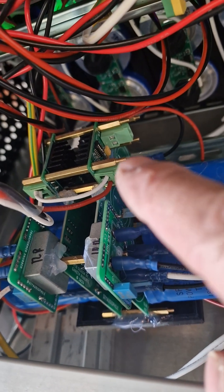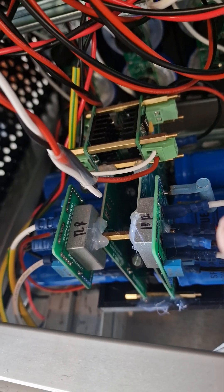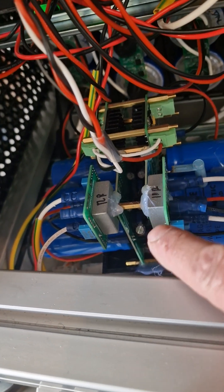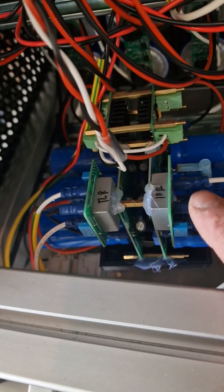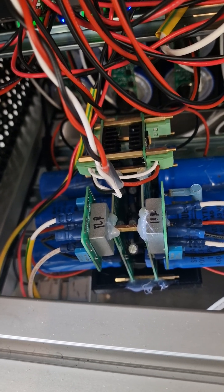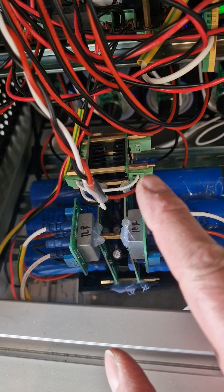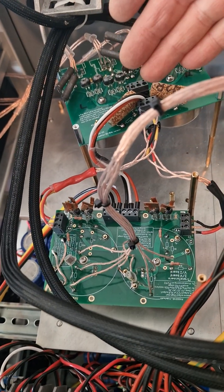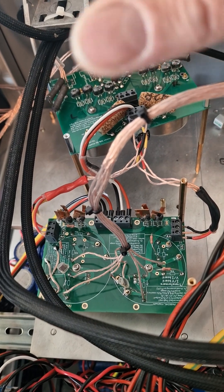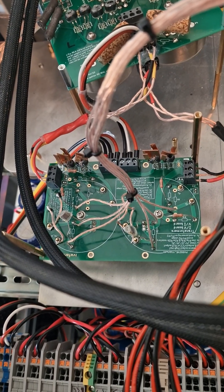I've moved over to a mains PSU rig — I'll leave the contact details in the description. It's 15 volts either way, with DIP switches for configuration — very nicely considered. I used a Quasimodo to balance the transformer secondaries on the diodes. The setup is fantastic — very little difference in sound versus the batteries; if anything it sounds a bit better because I can leave it on continuously, allowing the JFETs to warm up and stay warm. Active IVs are strongly recommended — it's a huge improvement.